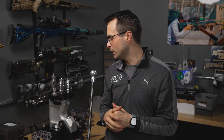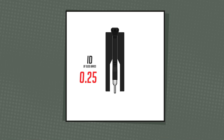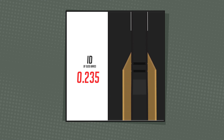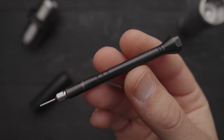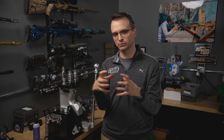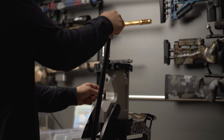The route we took with our sizing dies is to size that neck down in a single full-length, all-one-piece reamer-cut chamber to the point that the neck is sized down further than we would want it to finally be. Then, as you pull your brass out of the die on the downstroke, a precision-ground expander mandrel built into the die expands that neck to the final size we're looking for. If you're looking for a final neck size of 241 thousandths, the expander mandrel will be just fractionally larger — around 241.5 thousandths — so that after spring-back you arrive at that number.